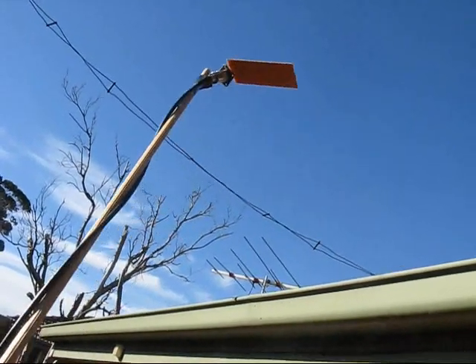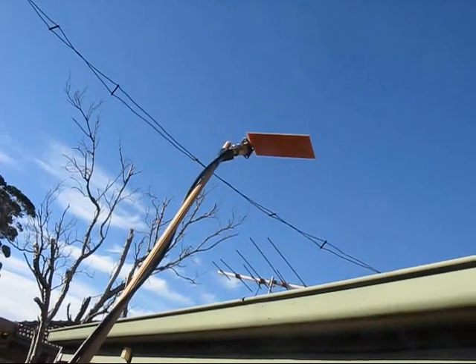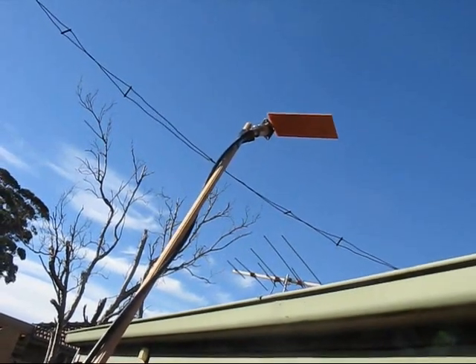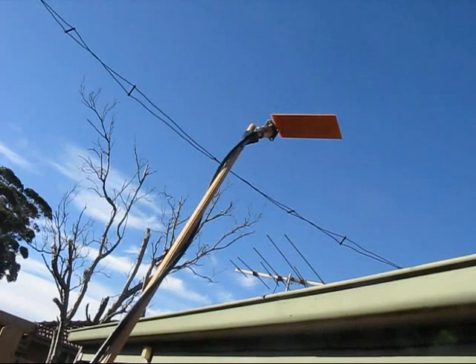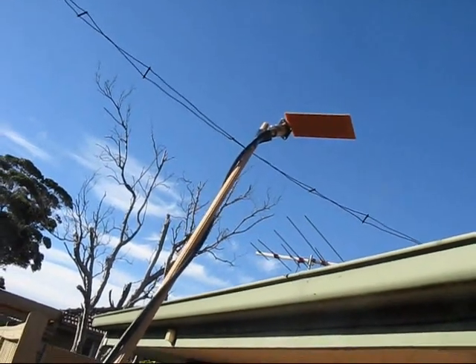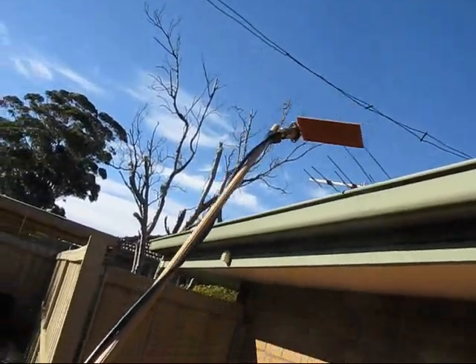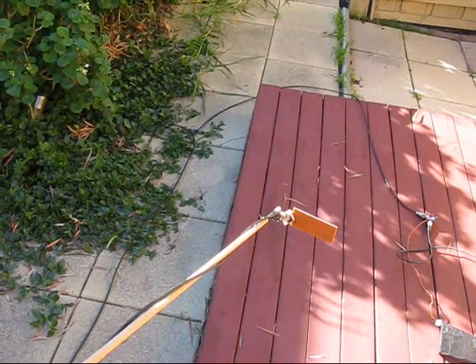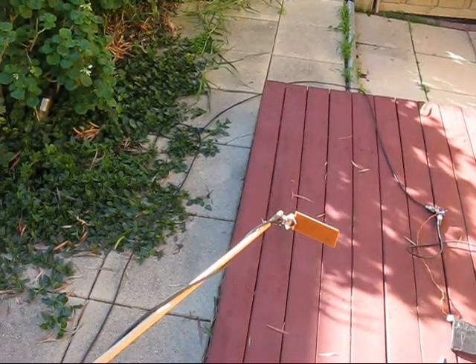While it's often suggested that having these antennas up in the clear provides better reception, it can be difficult to get antennas in the clear, especially if you're in a small unit. Gutters and other wires are often not far away. In some circumstances then, it may be better to have the antenna nearer the ground. Even if the signal level is lower, the signal to noise ratio may be better.